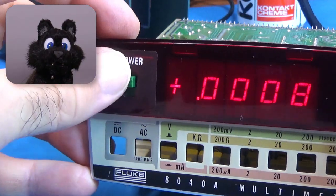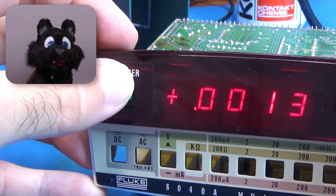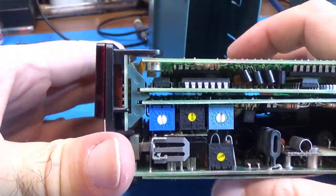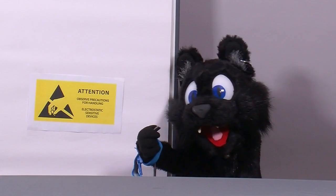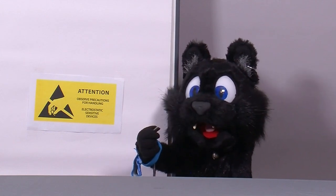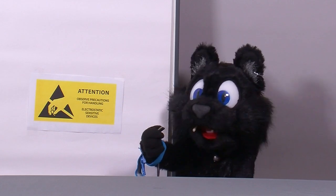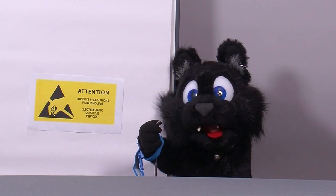Turning on... Yes! The leading digit is crisp and bright, and the auto range also doesn't buzz anymore. This is a good example of how chips act when they take static electricity — ESD damage. Vintage CMOS chips are notorious for that. Always use ESD straps and mats when dealing with vintage devices.